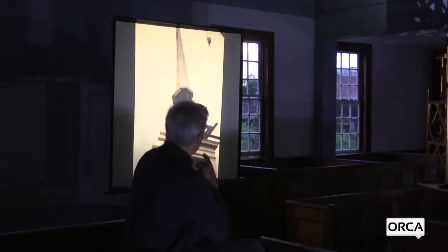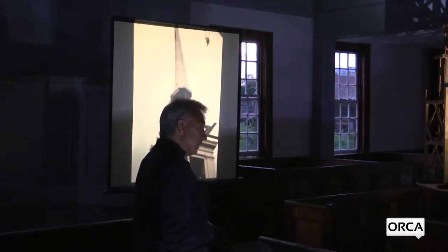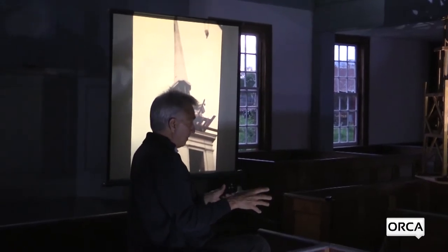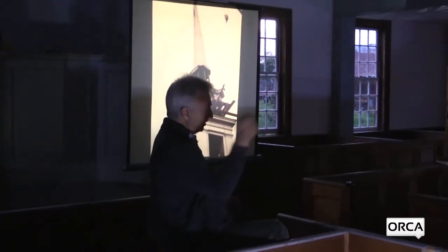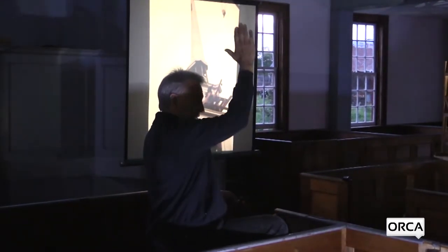And so in Castleton, those rafters are about 35 feet long. They're very small and light, but in the middle of that is a chestnut 9x9 that went down for 59 feet. And at the bottom, it was attached to nothing. It was actually just an axe-chopped bottom. Although since then, people have been nailing stuff to it all the time, saying, oh my God, look at this. But it was a pendant mast hanging from the apex.